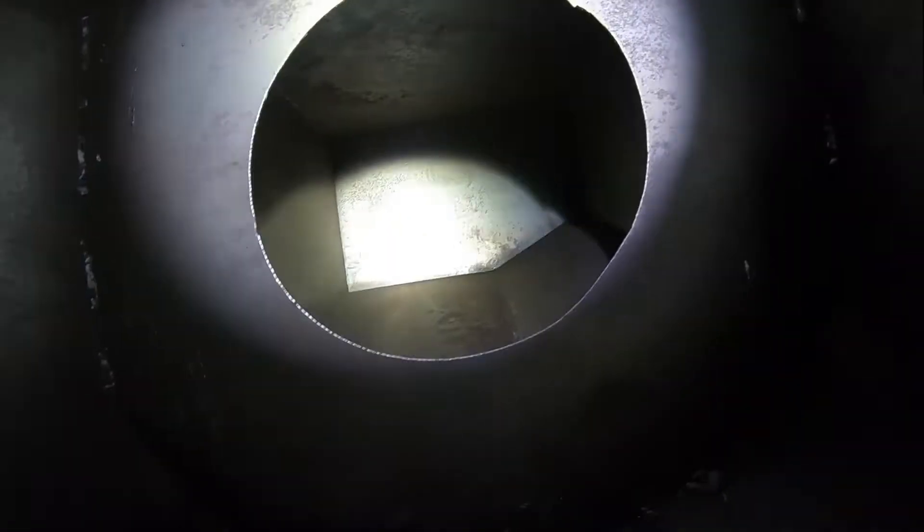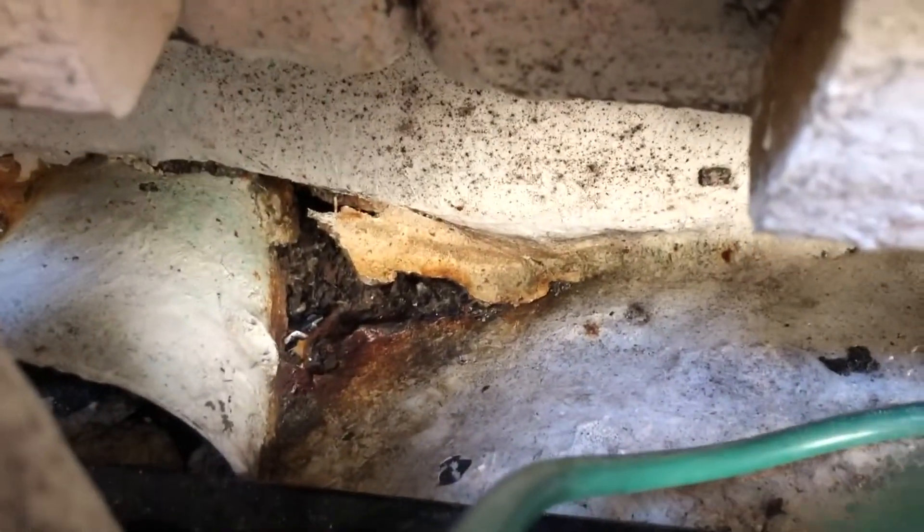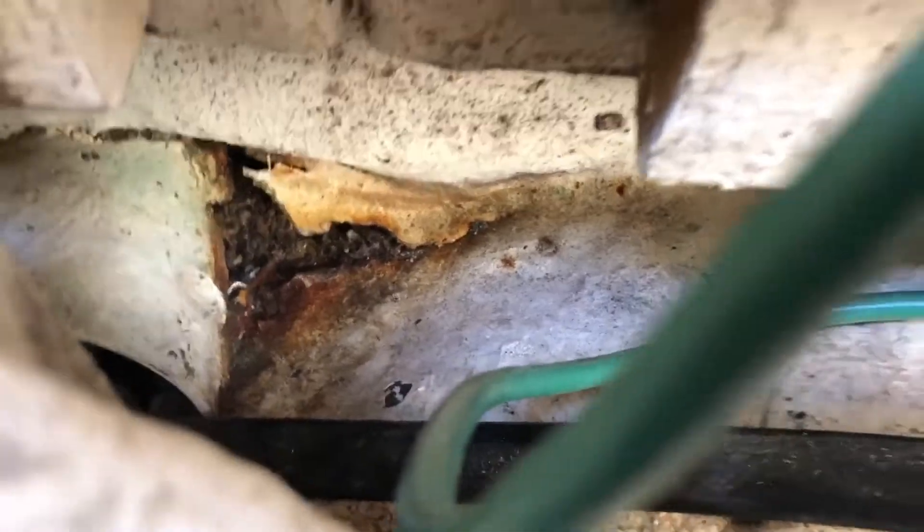While we were hauled out for our mast project we discovered that we had fuel leaking into our bilge. We finally exposed the piece of bulkhead that was covering our diesel tanks. There's a lot of bulkhead deteriorated and diesel on the starboard side — you can see how the tanks are rotting down there.